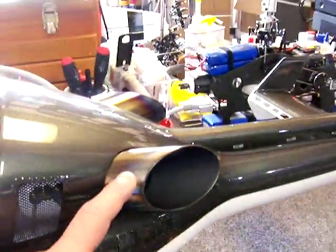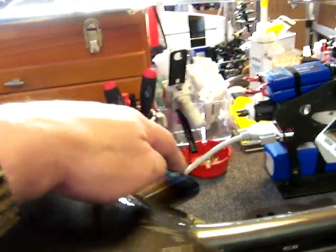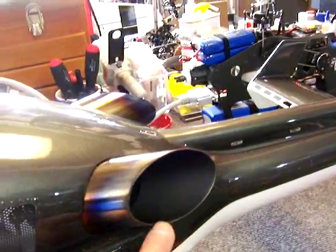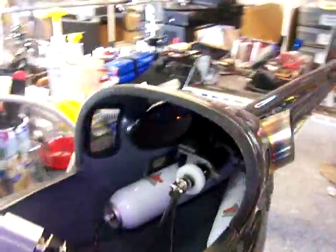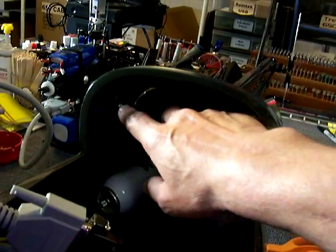These beautiful stainless steel exhausts were colored blue by Brian using his trusty oxy-acetylene torch. It turns out to get the blue on stainless steel, you want to blast it with air as it transitions from yellow to orange. We're also using epoxy putty to make standoffs.